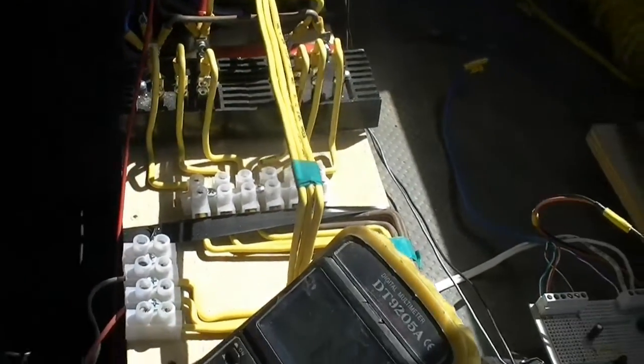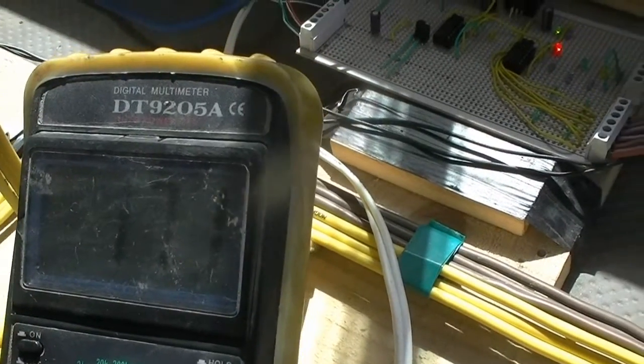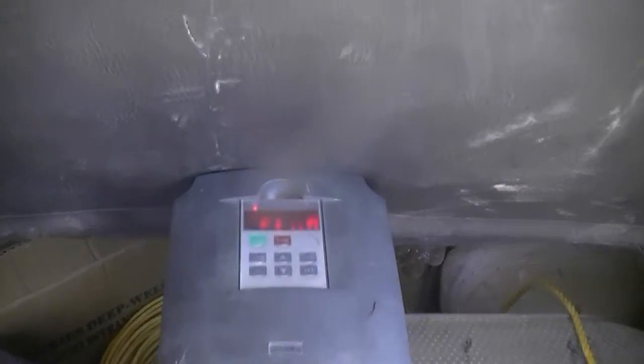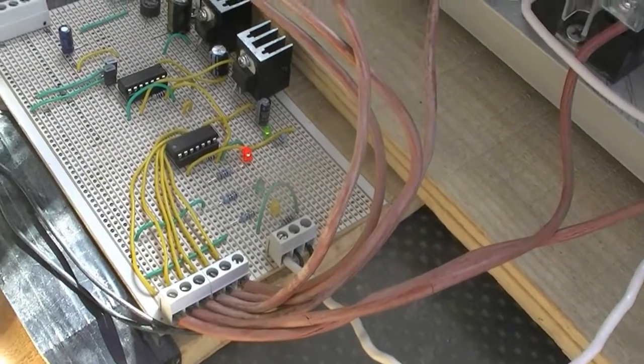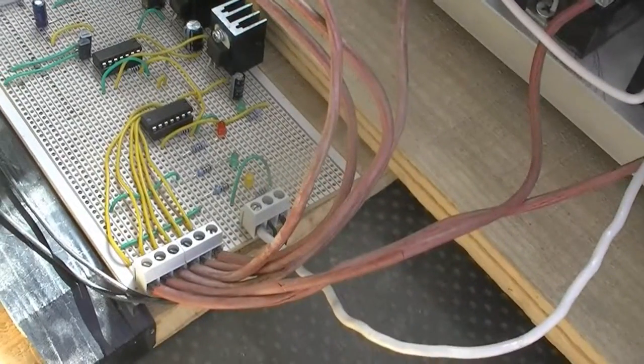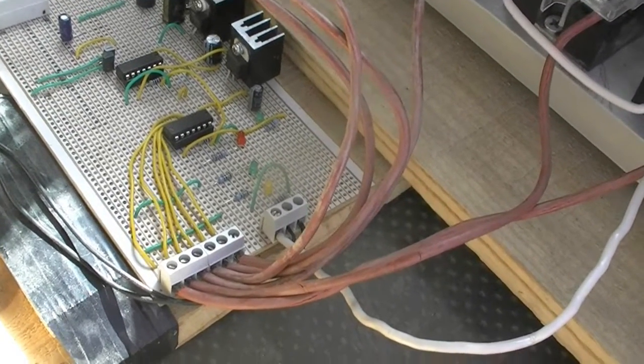What we've seen just now is that the voltage, because of the wind turbine — there's not very much wind at the moment — has gone down below 200 volts, which is below the minimum voltage for the VFD. The VFD has gone into a low voltage error mode. The circuit takes the signal from the VFD and will wait until the voltage goes back up to restart the water pump.